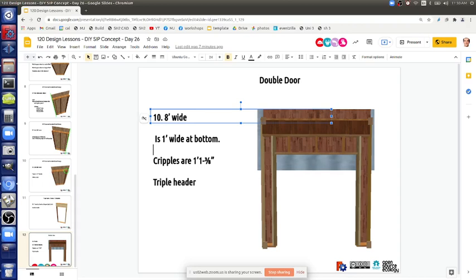So cripples are 1 foot 1 3/8 inches. So if you cut those to length, that will be at the right height. Yeah. That's pretty critical. I mean, you can't just measure that, can you? You can't. That's information we need here. Yeah. Otherwise, well,